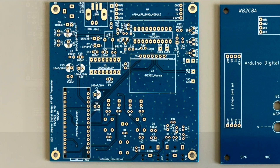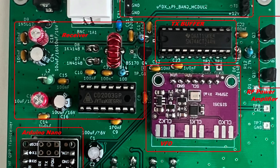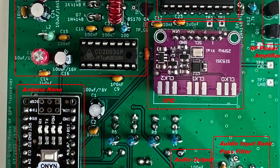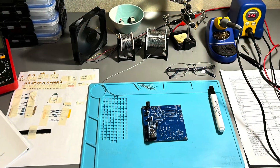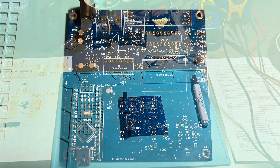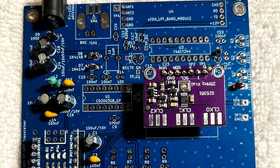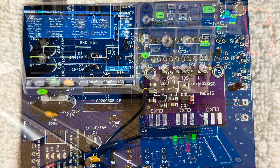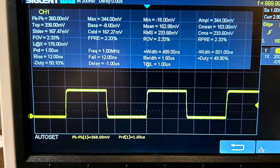The main element is the motherboard, which is a double-sided high-quality board that is a pleasure to work with. The board is laid out in logical modules and you build them one at a time, testing along the way. You start by laying things out, organizing all your components, and we start on the power supply and the Arduino section first. We then move across to the VFO, and once that's installed we add the control buttons on the other side.